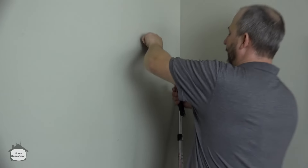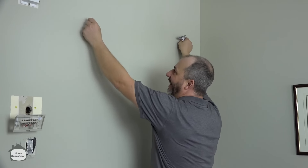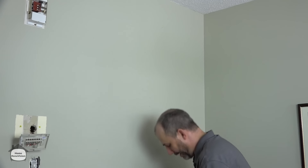Generally speaking, I don't remember the last time I saw a wall full of pictures with nails where every single nail missed a stud. Once we've got all our wall prepped and we're ready to paint, we have to prep our wall. Professional results — it's all in the preparation. We've removed all our cover plates, we've got our paint, but we have to fill our holes and check for dents and imperfections. Until we make the wall surface perfect, there's no sense adding paint.